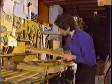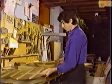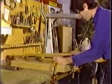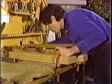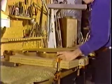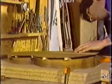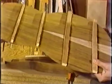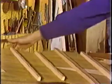I've done most of this before, and when I take it off, you'll see that I'm ready to take the back now and place it on top and basically line this up using an inspection mirror here. Once I've lined it up, I can then mark the position of the braces on the back. I've done that side already. And then I can flip the back over, and you can see these are positions where I've marked, and now I have to cut these braces and fit them to the curved members here.